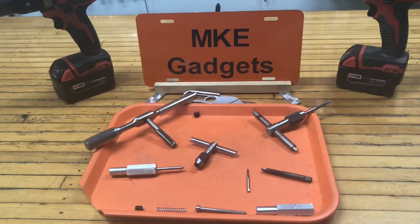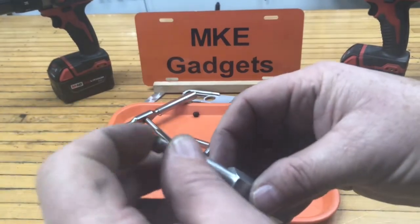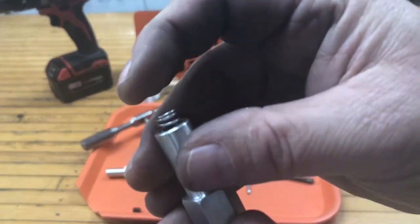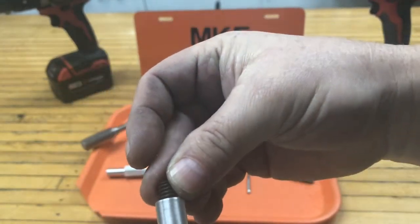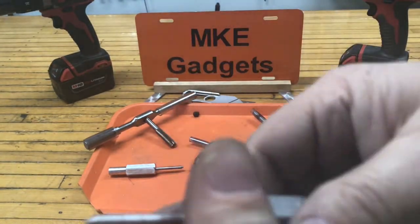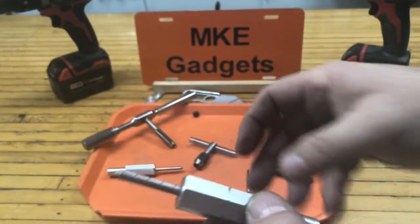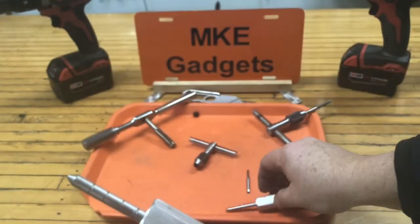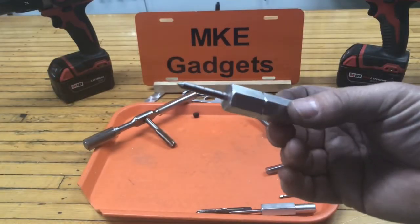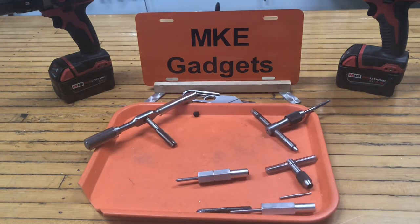With all the parts machined, it's time for assembly. The bushing is pressed on — if it's loose, a little drop of CA glue will work wonders. This should slide freely into the body. Push the spring on top, then your set screw. At the lathe I deburred all the edges and I put a little groove in there so I could tell the two apart. This one has the indicator grooves a quarter inch apart so as you're tapping you can tell how deep it's going. The second unique feature on this is the hex — it's not going to roll away on you. If you throw it on your bench or on your lathe, it's not going to roll very far before it stops.